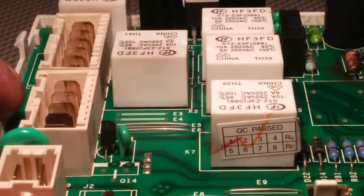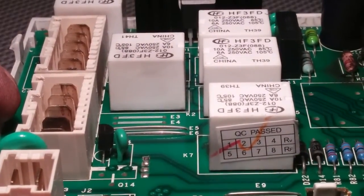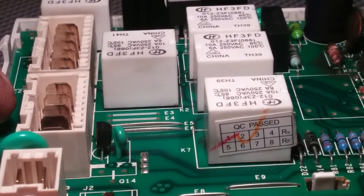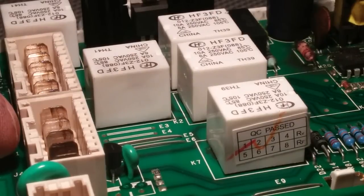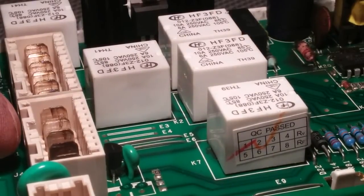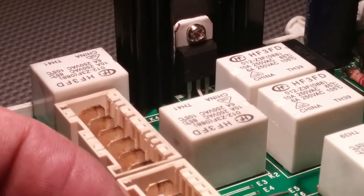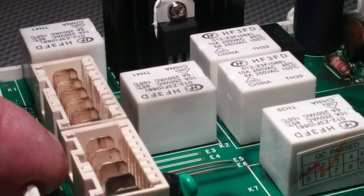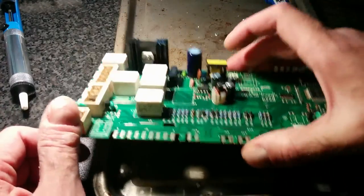Now these will cost peanuts. I'm going to go over to Maplin to find out how much they are. I hope they do have them in stock. So before I go on a journey, I think I'm just going to see if they have it in stock near me. I will also look if I've got any spare capacitors within this tolerance. I know I don't have any 680s. I might have some 470s. Not sure about 100. But yeah, we got those three capacitors replaced.